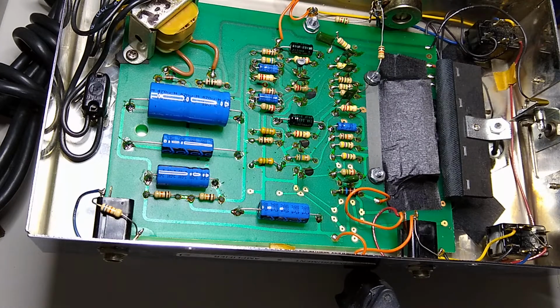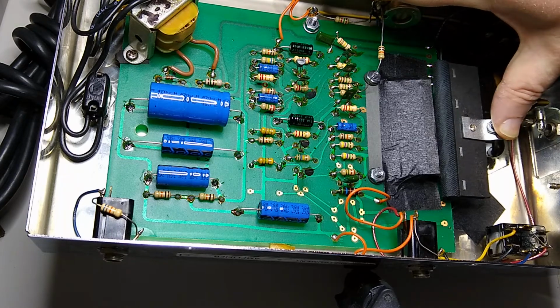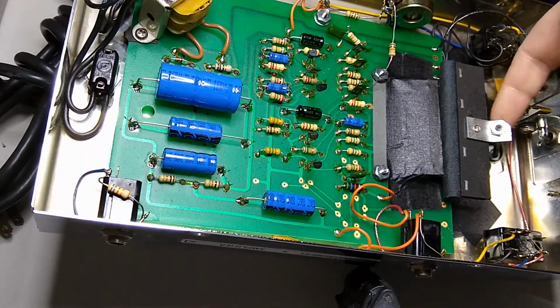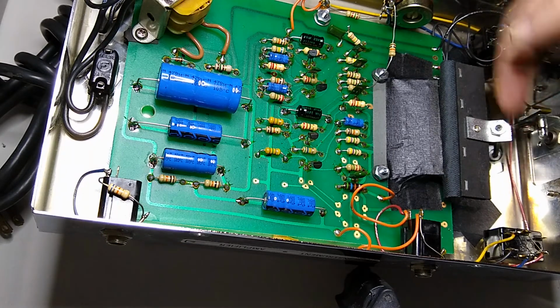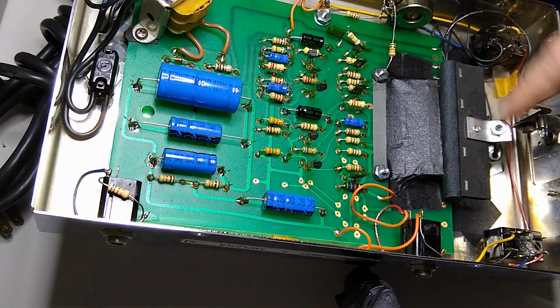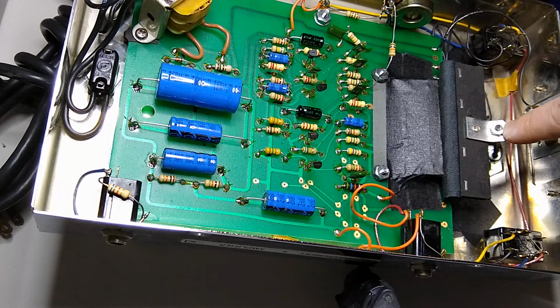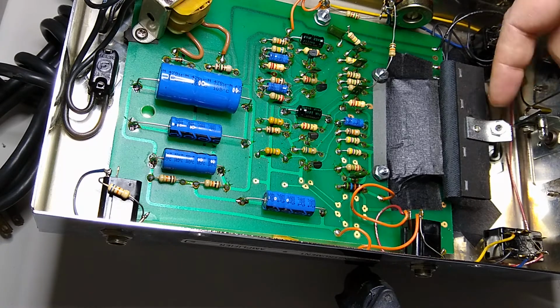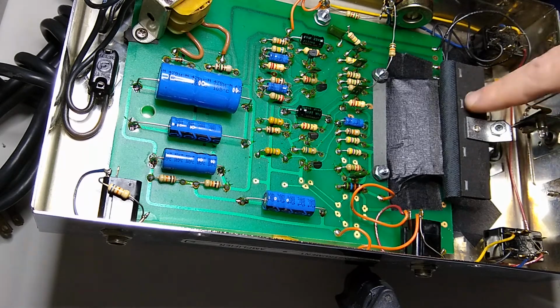The only trick is cutting it and getting it in there. You can adjust the shroud by bending this a little bit if it doesn't quite mate up. And you can also take this off and adjust the bolt underneath to where it needs to be. Usually it's just like a couple of threads in is where it needs to be at. You can also bend this tab a little bit if you need slightly more throw, but don't do it too much.